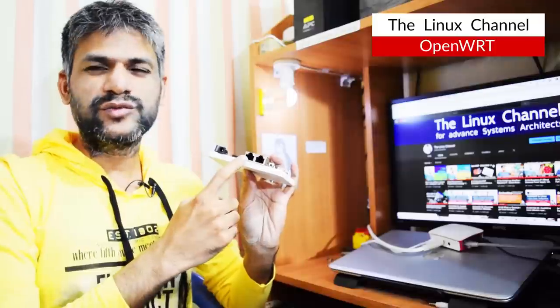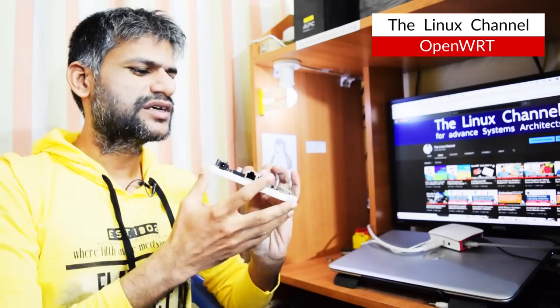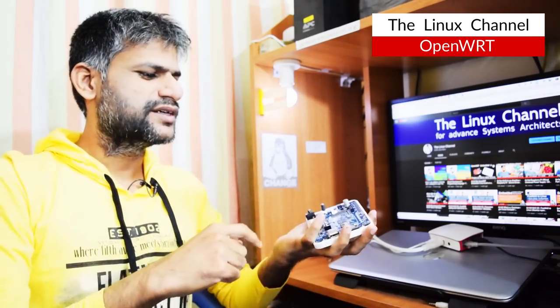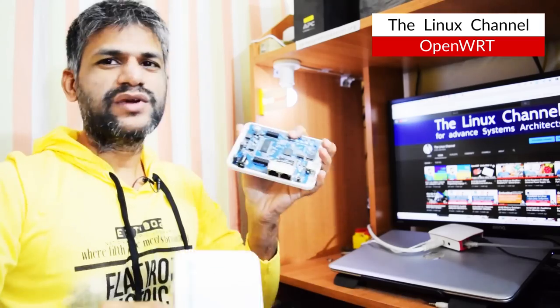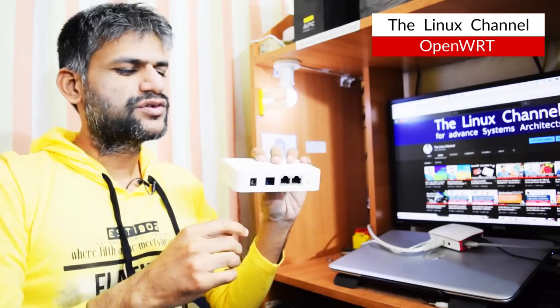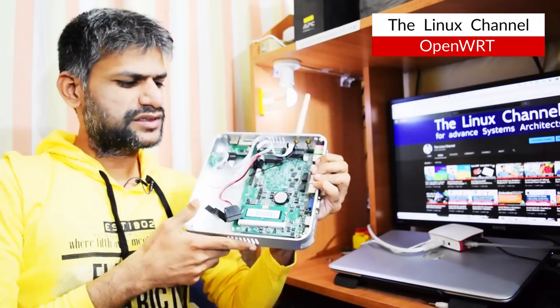You can see there are two ports. You can configure this as a LAN port, WAN port, and stuff like that. So you can make this a network router or some special bridge. And it has this Atheros chip here. This is a MIPS processor, not to be confused with an ARM processor. So this is one platform, but the main issue with it is its lack of performance. That's where you can get full featured performance with a platform like this.